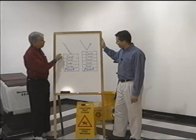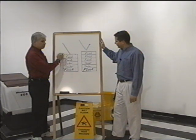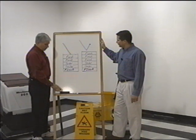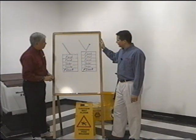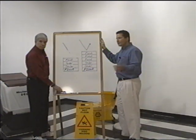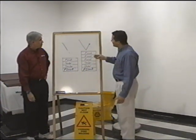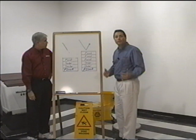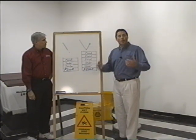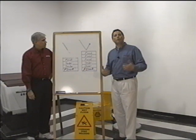Over a period of time, dirt gets embedded in the floor and it gets a worn look, and the light just no longer reflects off the floor, so you have no shine. What we're going to do is scrub off that top coat. And then once that top coat has been removed, we're going to replace it with one or two coats of new floor finish, which will then give us that bounce to the light and cause us to see that shiny floor that we've grown accustomed to.